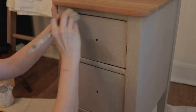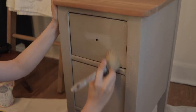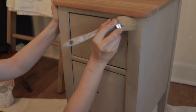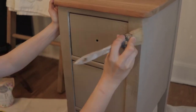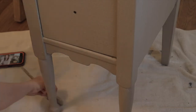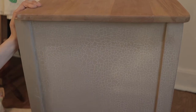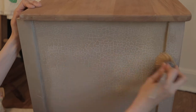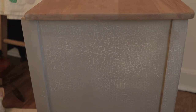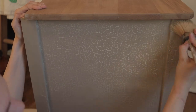Once my second coat was fully dry, I actually kind of liked the crackle finish — it was really unique and I loved how it was very consistent throughout, so it looked really cool. I went ahead and chose to seal it. I don't normally seal with a paste wax, but in this case I was worried that some of the milk paint would chip off if I used a liquid sealer. So I played it safe and used Johnson paste wax that I had on hand. One thing I love about this wax is that it's very affordable — only about $10 at Lowe's and readily available. One thing to note: if you're painting a piece that's white, it will kind of leave a yellowish tint, so you really need to make sure you rub it in well.